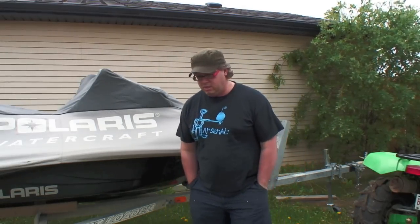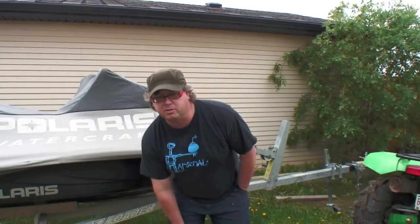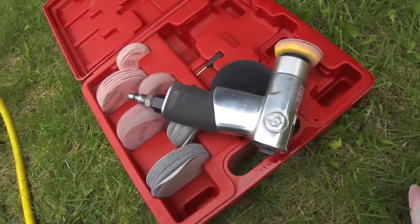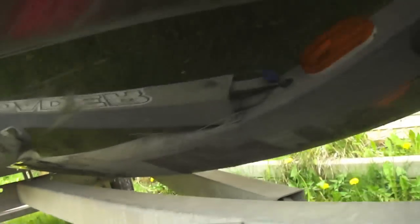Okay, so now we're back the following day and we're going to finish the repair of the gel coat on the bottom. We let it set for 24 hours and it's a little bit rough right now. I'm going to show you how to sand it down and how to go about polishing it. I'm going to start off with a 320 sanding pad and then finish with 600, which will allow us to polish it up. A lot of it's all sanded down now and we're ready to polish up the bottom.